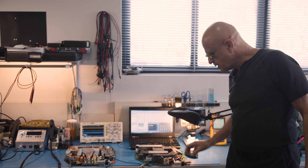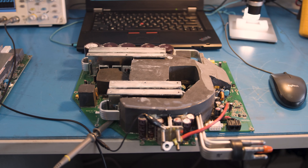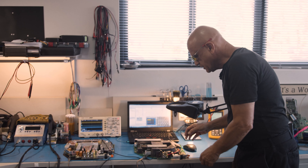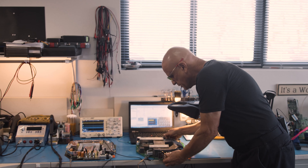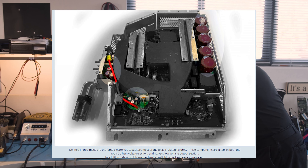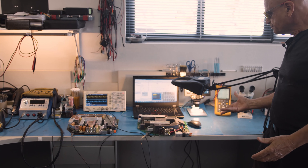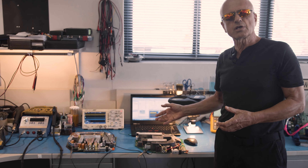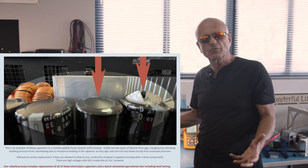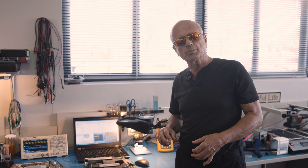The old MarTech unit is difficult to service because they potted everything. You can see this gray potting compound poured on top of components and MOSFETs. The main thing that we do during a rebuild is change relays and these filter capacitors throughout the DC to DC converter. The fundamental reason is that electrolytic capacitors have a shelf life — they age, become resistive, and don't last forever. It's recommended that every eight years these electrolytic capacitors get replaced.